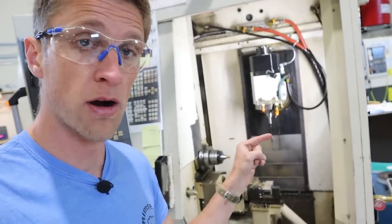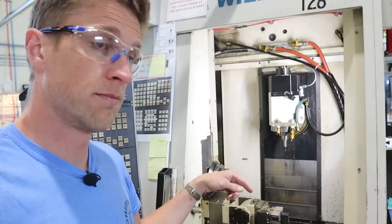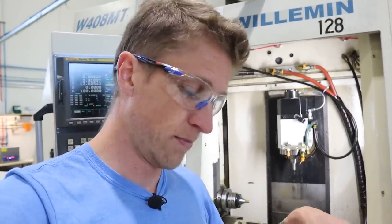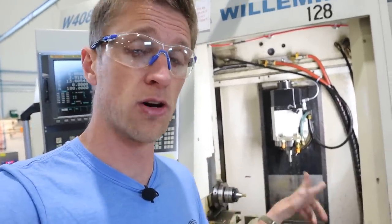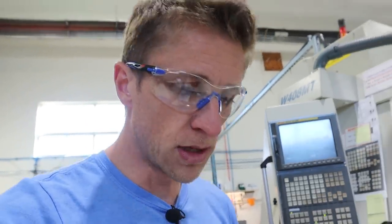As it is, we've already pulled the bar. Now that I've pulled out my part, I can hit go again and it'll make the next part, but I don't have a way to eject the part automatically right now. For other parts we're making it just ejects automatically and they go down — it's amazing. I've dialed in all my tolerances for brass, but once you go to steel, everything goes out. Steel is harder to cut — if you dial in a perfect quarter-inch diameter in brass, it's going to be bigger in steel because it just takes more cutting pressure. Not a big deal.